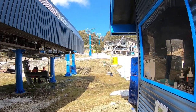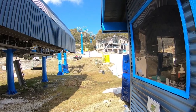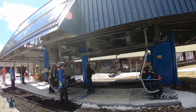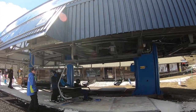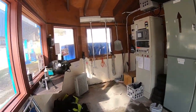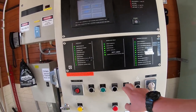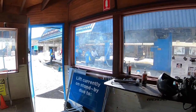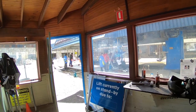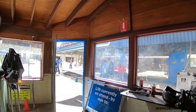Check your enclosure again - it's all good at the moment so we don't have to touch it. When doing training down here, explain the white teeth to people - how they can break, and that if they start seeing stress fractures they should call that in early. You can also run through the anti-collision system: explain that if they were to override the anti-collision, they need to be looking outside and making sure all the chairs are moving. If the chairs aren't moving for whatever reason, they need to stop the lift immediately.